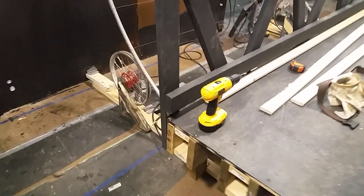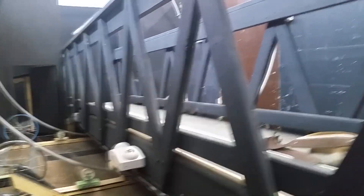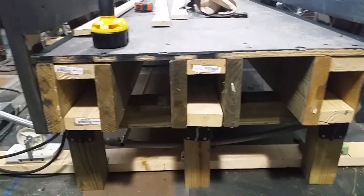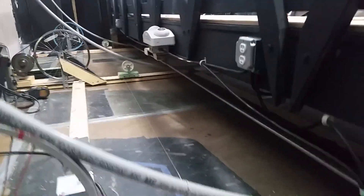The build probably cost us about $250 to $300. The bridge railings are both lagged into a 2x8, because when people go through this thing they're going to be leaning heavily on the railings, so they definitely need to be sturdy. All the electrical is hardwired and we even have an emergency light in there. The bridge itself is six 2x8s on edge, which can support a ton of weight. The 4x4 legs are only supported at the front and at the back — nothing in the middle. They're pretty strict with building code, so we didn't bother with stairs; we made a two-level ramp system to get on and off.